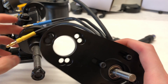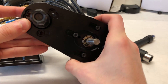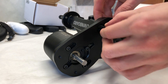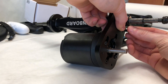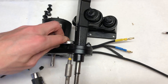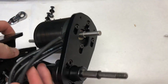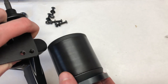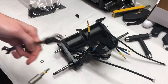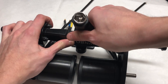As mentioned before, the motor mount has two positions in which you can mount it to the truck. This is particularly useful because we found that Evolve mounts and trucks can't be used on a lot of decks because the motors will hit the back of the deck. We mounted the motor mount onto the trucks using the three screws that came with it, then attached the bolt on the opposite side. This part is a little tricky because there's not a lot of space for the wrench or allen key.